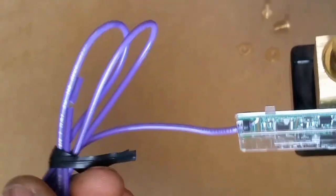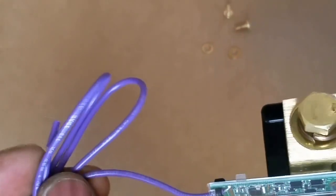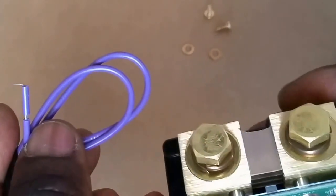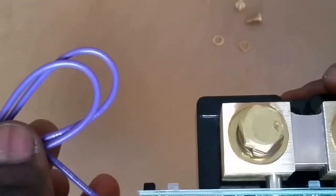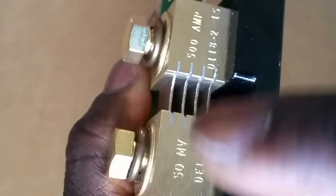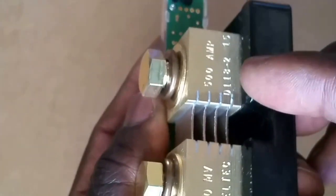Voilà — the Whiz Bang Jr. is already installed. This is how it looks. This wire is going to go to Aux 2 on your Classic 150. Remember, this side here is the load and this side is for the battery. That's why this wire has to face and point that way — they have to go in the same direction.